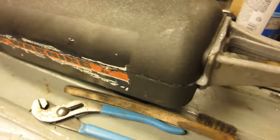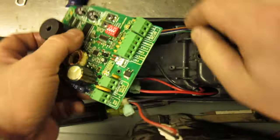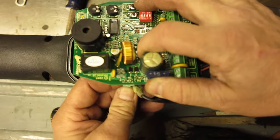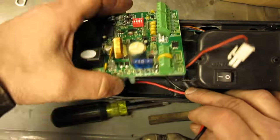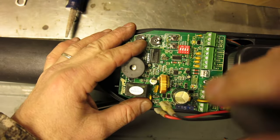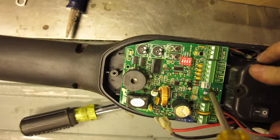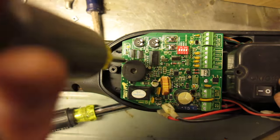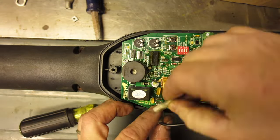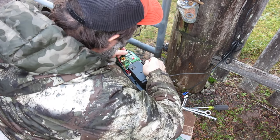It's always a good idea to keep track of which wires are which. This first connector is a unique connector for this circuit board, but the next four are spade connectors — keep track of them whatever way works for you. Nowadays I normally take pictures with my phone. Those first two spade connectors go to the switch; the second two up top go to the motor. I'm tightening this screw with a hand screwdriver because it goes through a circuit board — I'm less likely to crack the board or strip out the plastic post if I do it by hand. I love electric screwdrivers, but there is a time when a manual screwdriver is the better tool.